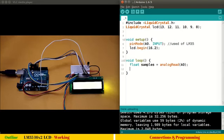So with this 10-bit ADC, let me write it down, it will be easy to understand. Each digital sample, we know that maximum it can go up to 5 volts. So each digital sample could be 5 volts divided by 1024 volts. Do you agree? It's as simple as that. 5 volts is the maximum analog voltage and 1024 is the maximum digital number of samples. So the 5 volt value will be converted into 1024 in digital. 5 volt is analog, 1024 is digital binary.